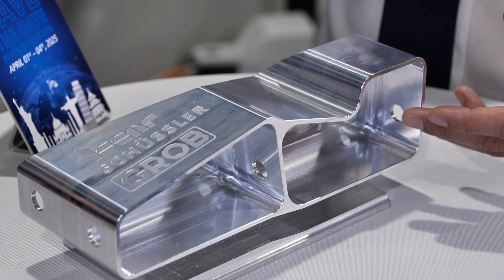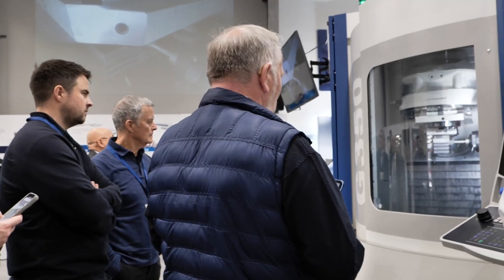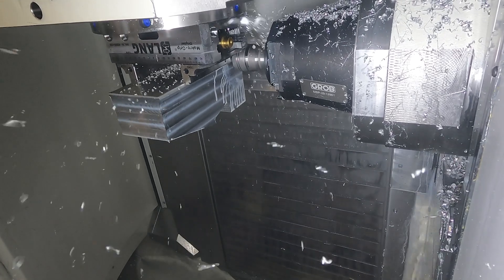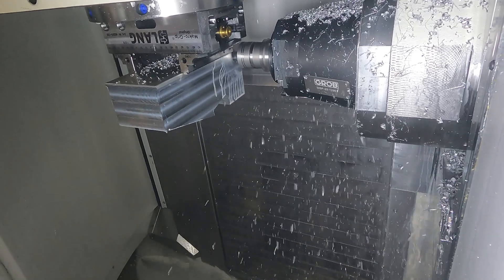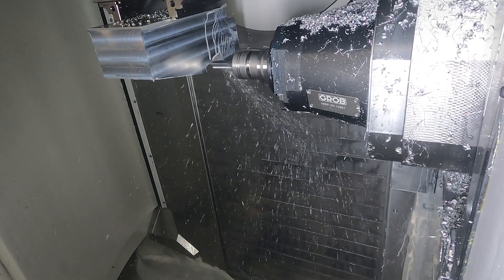The key features chosen for this demo part include pocketing. With deep cavities on any vertical machine, you'll re-cut your swarf. As you've seen in the demonstration, with the Grob you do most of the work upside down — the swarf falls away, and at the end of the cycle you've got nothing on the bed. Any engineer can relate to swarf compacting on a four-axis or vertical machine. It really is a problem in industry, especially with high-volume aluminium parts.